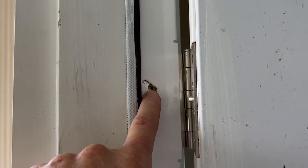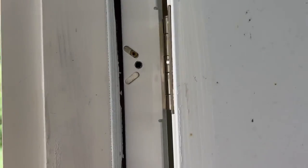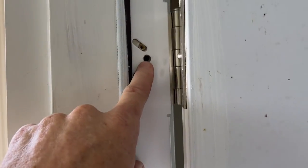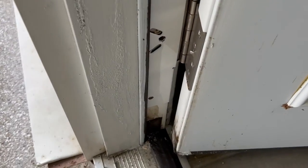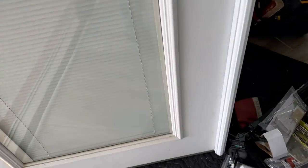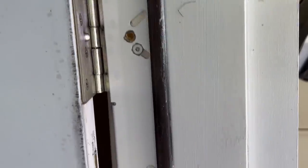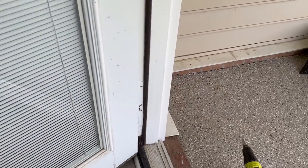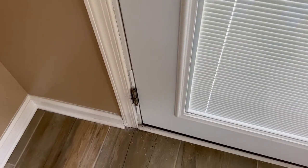I take the screw out of the hinge because I'm going to put in my long screw there. I've got two short screws holding it in and I drilled out that hole so that nub can go in there. I did the same thing down below. Now we're going to test it. It binds a little bit, but it's not bad. Those are drilled out — we'll do a test. This one has a much bigger gap so there's no binding here. We got lucky and everything's good.